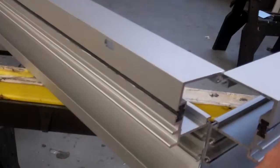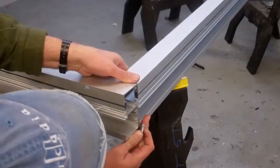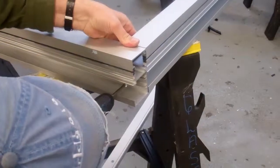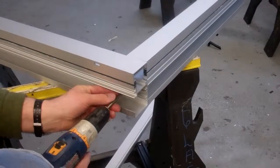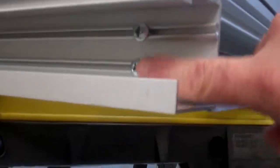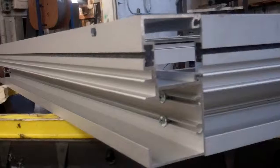It is critical that the contour of the jamb has a generous amount of sealant at every point that will be in contact with the sill. Once the bolts are connected, apply sealant at the heads of both bolts, and apply sealant where the bolts go into the jamb at the screw bosses — that's very important. Do this on both corners of the sill-to-jamb joinery.